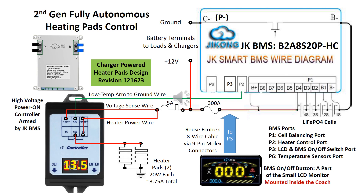Once the battery is warmed above the cold temperature set point, the BMS will turn on charging and float the heat port ground, thus cutting off power to the relay controller. This new design is efficient and will not draw down the battery for heating purposes.